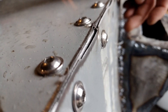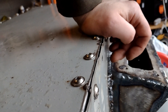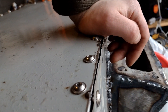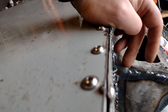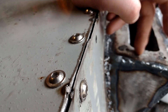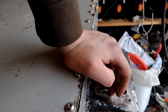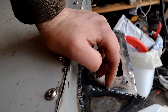My welder is terrible — the motor feed is taken from the transformer taps depending on which switch setting you're on. At the very lowest setting it hasn't really got the power to push the wire through, so it gets really bad. I'm going to try to address that by supplying the motor with a PWM motor controller for the wire feed, but that's for another day.